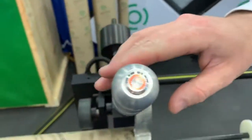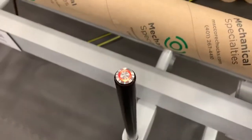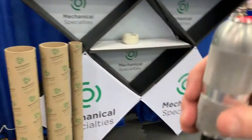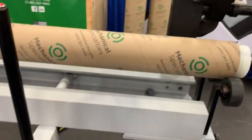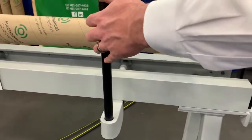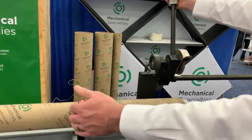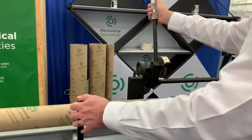If you look at the handle and also over here, what we have is our safety switch — they both are illuminated to let the operator know when power has been brought to the machine at all times. We have the safety switch set over here so the operator's hands are totally away from the drive chuck and the blade at all times. This way it limits any workplace accidents that could occur with this machine.